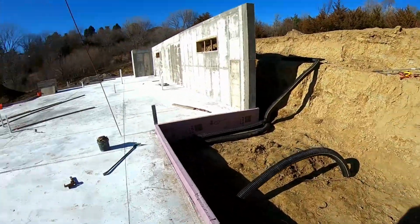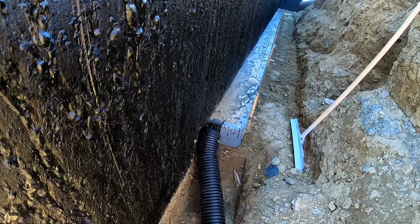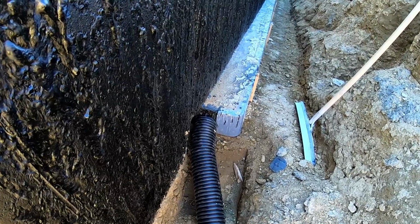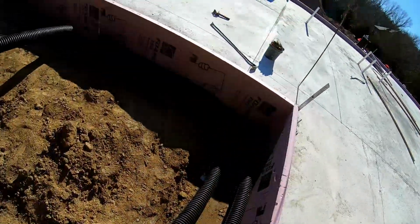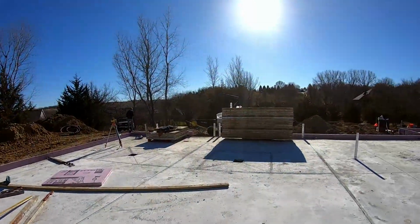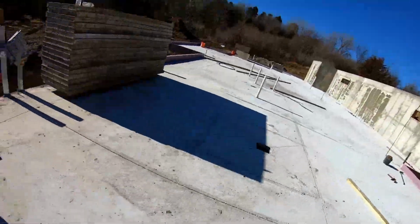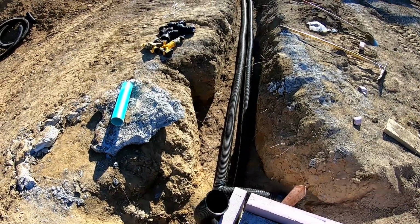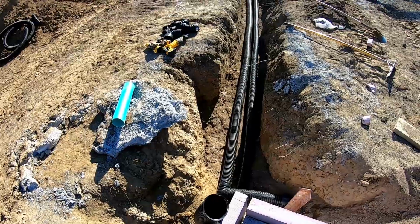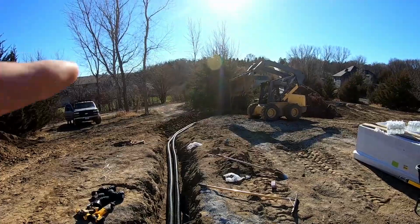And then on the back side of the foundation here, in previous videos I talked about the drain tile for the foundation. And so I have a drain tile that ties into that and is going to daylight out in the yard. That line is tied in with my garage floor drains, and both lines, the gutter drain combination line and the foundation drainage and garage combination line, are both gonna run out and drain out underneath those trees.